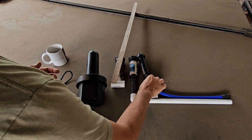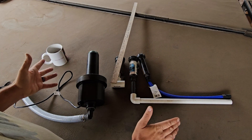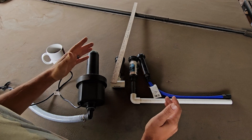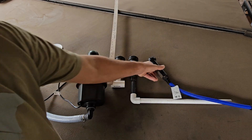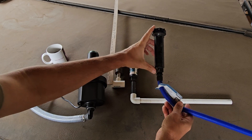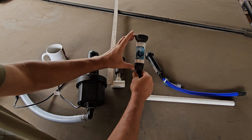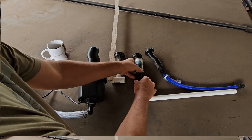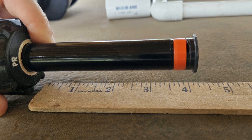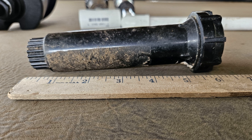I'm over here at my hot tub. I'm not a professional irrigation installer, so I haven't dug up as many of these as many workers have. But in all my time dealing with sprinklers in my yard and other people's yards, I've never actually dug up a sprinkler taller than 4 inches. Now, I should note that '4-inch sprinklers' don't refer to the height of the body — it refers to the height of the actual pop-up sprinkler nozzle. This 4-inch body is actually about 6.5 inches tall top to bottom, but the nozzle on the inside is 4 inches.